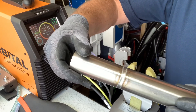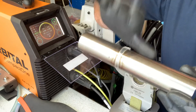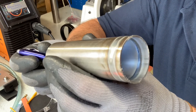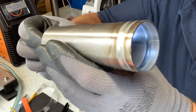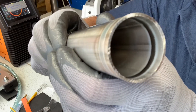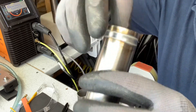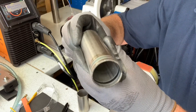Nice weld — it's a light hazy gold colour around the weld. Now we're going to cut this pipe to have a look inside and see what the weld looks like internally. Torch up there and as I twist that around it's nice and clean inside — perfectly clean. And there's the weld inside. Nice and flat — absolutely perfectly flat inside, and nice and flat on the outside too. That's a well-finished weld.